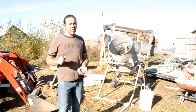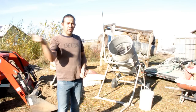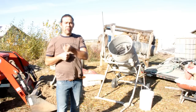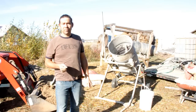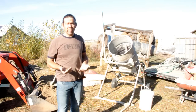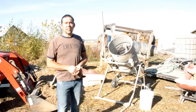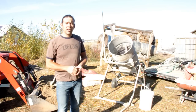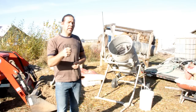If you're doing it by yourself, it's going to take you longer because you pick it up, put it down, spray for a bit, come with your trowel, knock it all down, then spray the next area, knock it down again. Whereas if you're troweling it on, it works much better. The other thing I like about troweling is that when you're initially putting it on, you can really push it into the straw and get a really good bond that way.